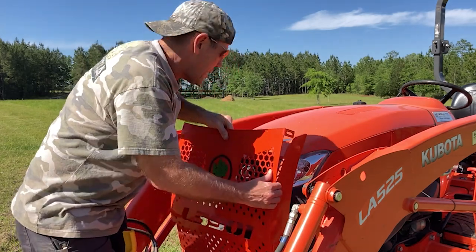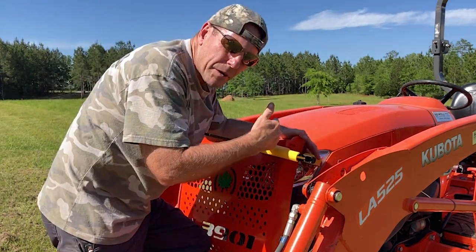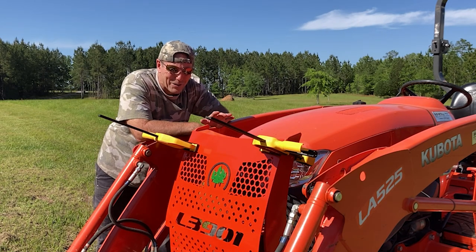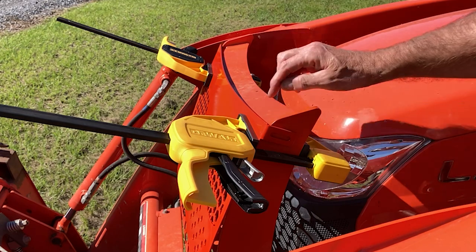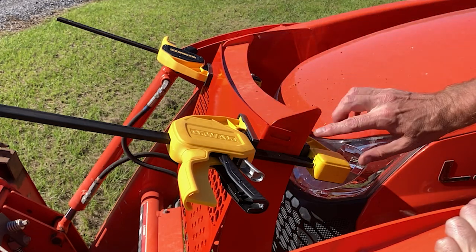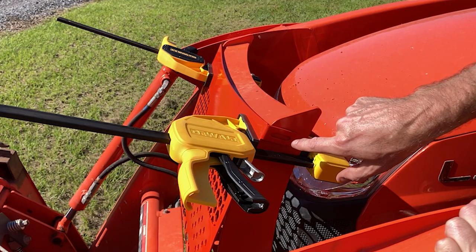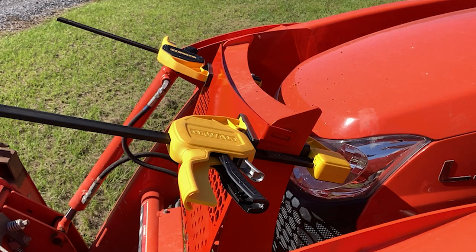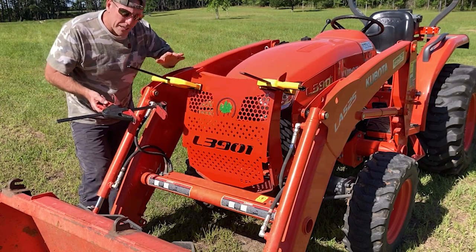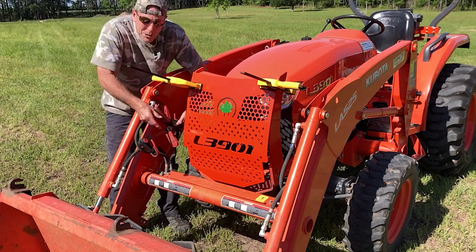I don't have my helper Miss Piney Grove today so we're going to try and do this solo — I brought some clamps to hold it in place. Once clamped I'll bring you in closer so you can see. I'll be honest: I tried to install this without clamps and couldn't do it. I'm trying to get this even on both sides, since it rides on the outside of the metal for strength on top. I'll also clamp the bottom so it follows the contour of the grill exactly, then pin punch the holes on all four corners to drill and insert the bolts. Another pro tip: take your loader off before you do this.